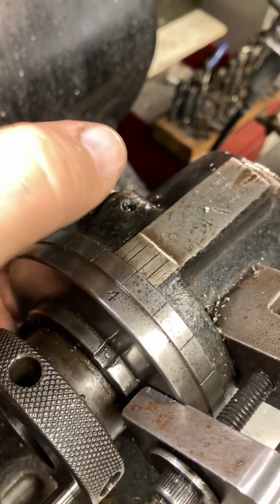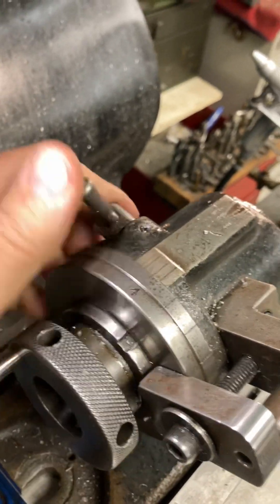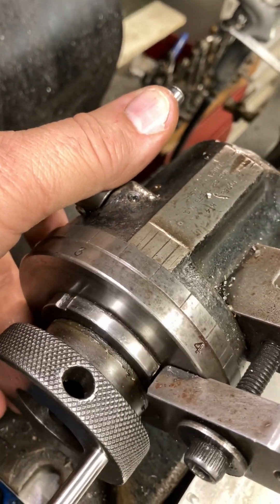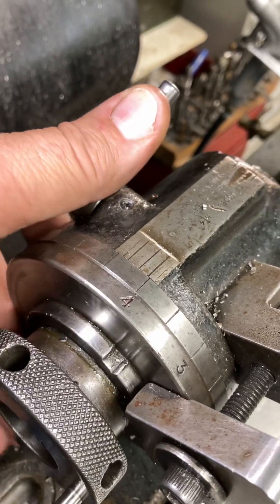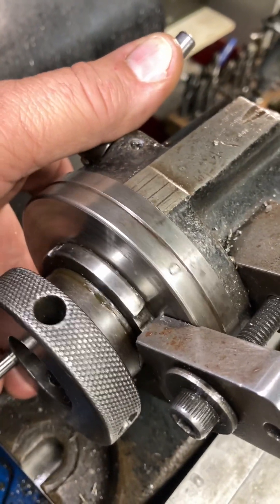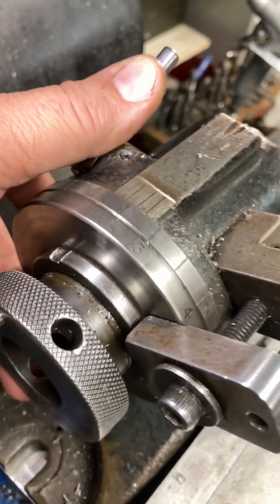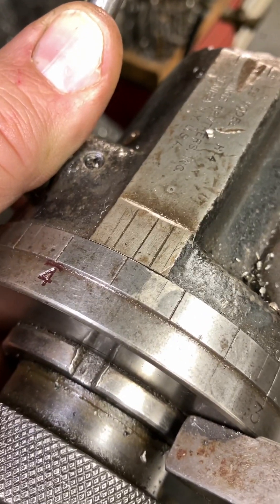You can see it's calibrated there. Of course I don't have a collet in — it's not turning easy and I'm using my left hand — but there we go. So this guy is 15-degree increments, and of course the 90s are on here. I'm at 120 — you can see that is on there with the three. And then you have your 15.